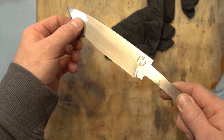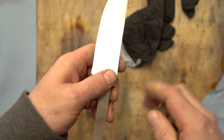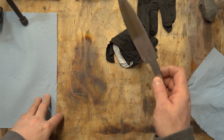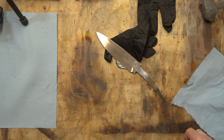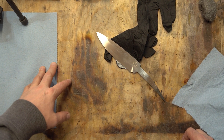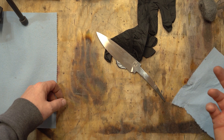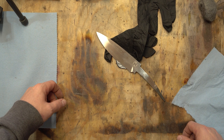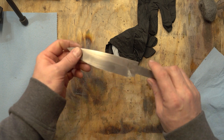The ferric wouldn't eat away the 1084 that I was etching, so I'd get a slight pattern that would just rub off. What you need to do is dilute your ferric chloride. I have mine at one part ferric to three parts water. Some people do four parts water — that works too. Three to one, four to one both work, it just has to be diluted.